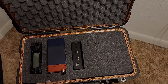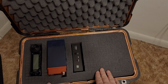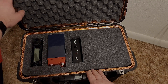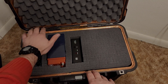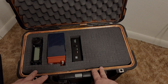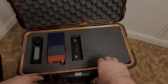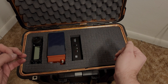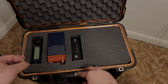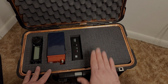Remember, the reason I have foam separating the equipment from the edges is you don't want any of the equipment touching the metallic side. If you're going to use a garbage can or an ammo can, make sure it has a nice tight seal — there are conductive seals available. These Pelican cases have a seal, but I put conductive tape underneath it so it actually touches the ridge. Do the same with ammo cans or trash cans, and make sure your radio equipment isn't sitting on anything metal — keep it separated. Pelican cases are great but expensive; I bought this one used on eBay for cheap — it was used to hold wine — and replaced the foam insert.